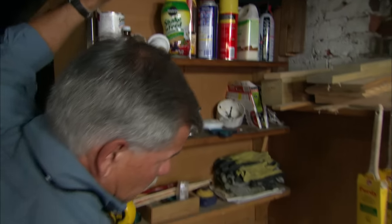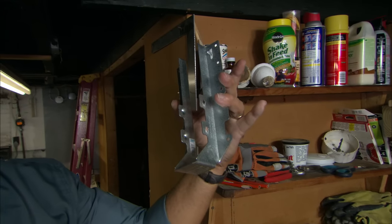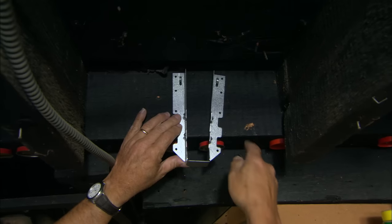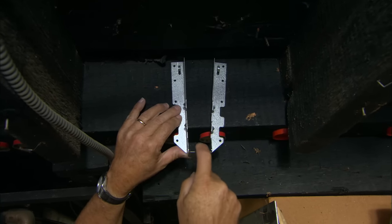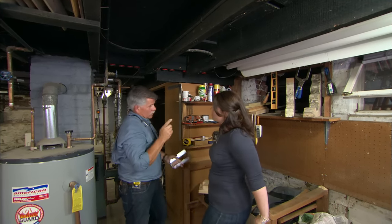The reason it has failed is because of the way the house is built. Years ago, they would cut halfway up the joist and leave a shelf on it that would fit in a notch cut into the carrying beam. But the problem with that connection is, with all the stress from people walking in that area, you put a lot of stress on the joist moving it up and down, and that weak part causes the joist to crack — and that's exactly what's happened here. Why would people build houses like that? Mainly because they didn't have metal joist hangers, which you nail against the side of the carrying beam so the joist sits in it, being carried at the bottom instead of halfway up.